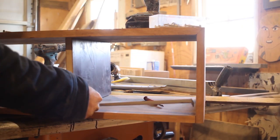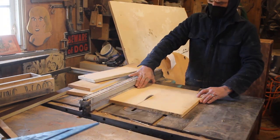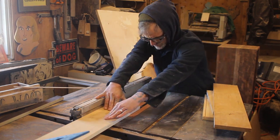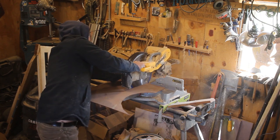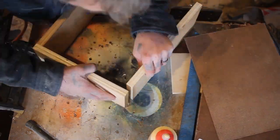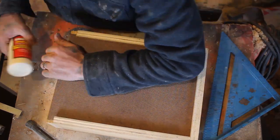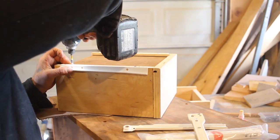I screwed them into place and started to build the drawers. When I'm building drawers, I like to cut the front and the two sides to the same height, and then the back I cut a little shorter. Then I lowered the blade down to half the thickness of my three-quarter inch plywood and ran my front and two sides through the saw, removing a channel which I'll be sliding eighth-inch plywood into. I used glue and some brad nails to put these drawers together. The eighth-inch hardboard slides into the slots I've cut and lines up perfectly with the back of the drawer. Once I had my drawers all set, it was time to put the drawer slides on — just some I had laying around in my workshop.